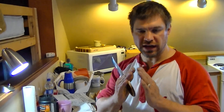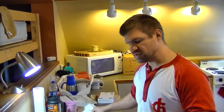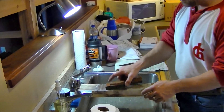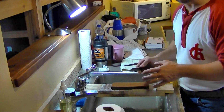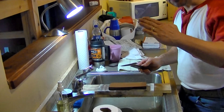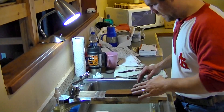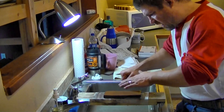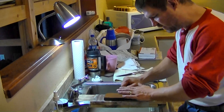What would you do if you wanted to reproduce the edge geometry on one of those thicker or fatter survival knives with convex edges? What I would recommend is when you're at your 1000 grit or your rough sharpening stone, essentially what you need to do is polish all the different angles — the different facets of that blade. You're going to sharpen close to the primary edge, then sharpen behind that and lower it again, and sharpen behind that and lower it again, repeatedly.